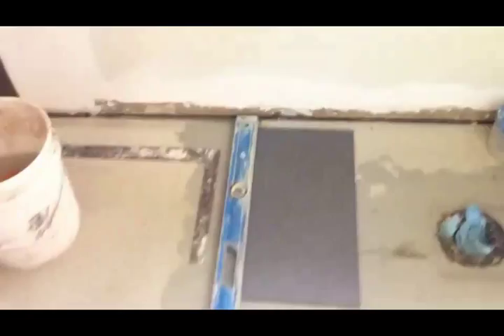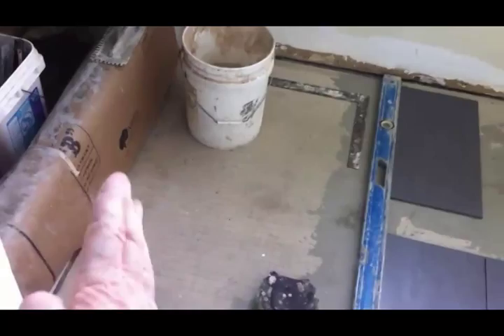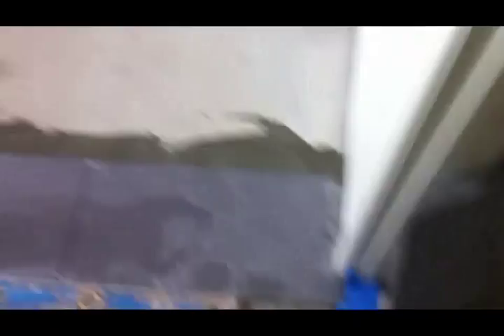I'm laying out for my floor — my tub's all done. I'm using my six-foot level as a straight edge and checking my cuts. This room was pretty square. I'm doing a dry set — just setting the tile on the floor to see what kind of cuts I'm going to get. This room worked out perfect: no little cuts, no little slivers. Make sure it's all the same.